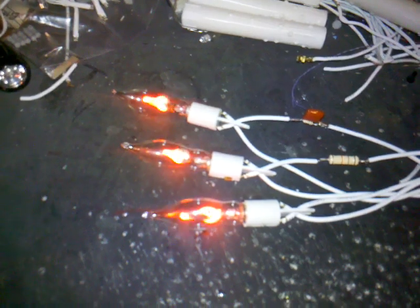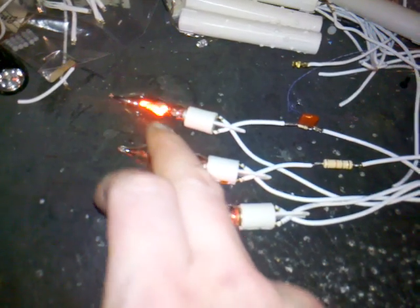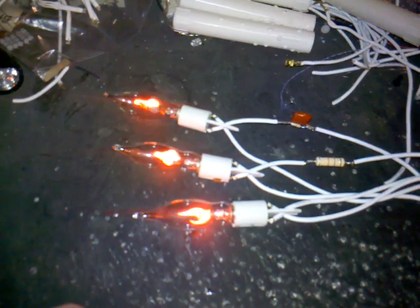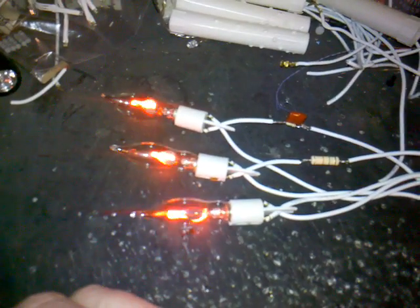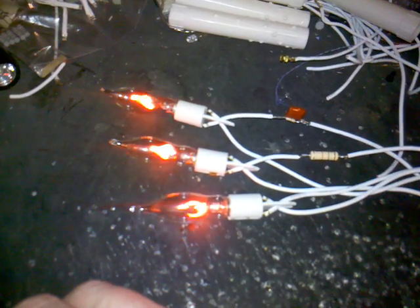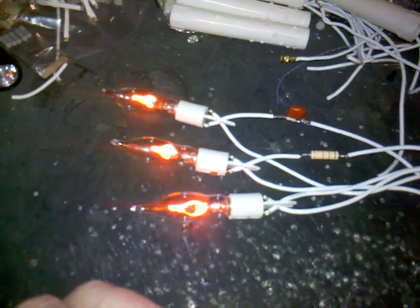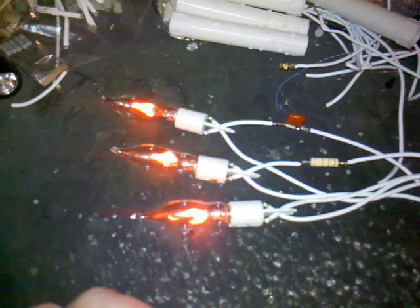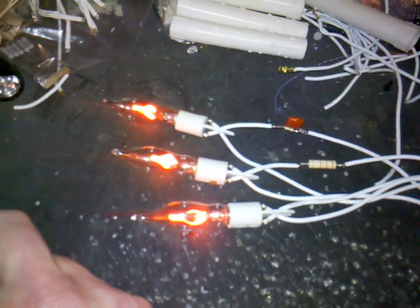This external resistor will get slightly warm, but the resistor in the base will not be getting particularly hot at all. A touch test showed that the original lamp was very hot to touch, the resistor-modified one was modestly hot to touch, and the capacitor-modified one was at body temperature — very cool. That's a good result; it means the lifespan will be a lot longer. And if this one shorts out, the capacitor will just act like an interference suppressor, limiting the current — it won't blow up or get hot, it will just remain as if nothing happened, which is perhaps another bonus.